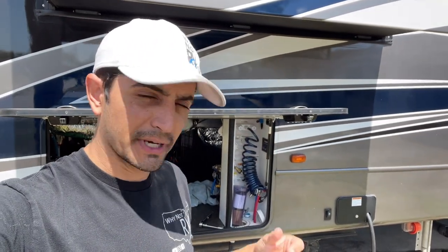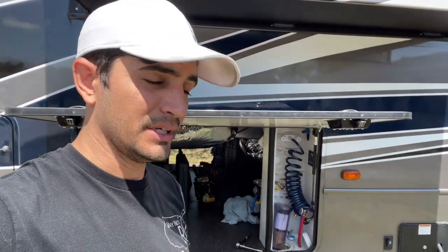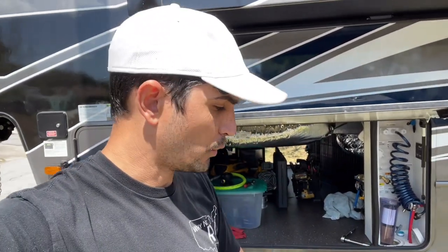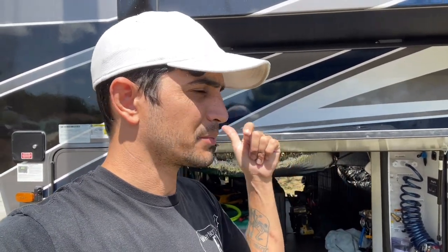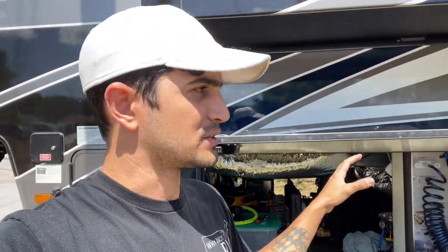I got the BMS all wired up with ring terminals on the end, so that's ready to go. Next I need to take out my old batteries and start putting in the new batteries. I've brought out one 48 volt set right here. I'm going to turn off my solar charge controllers, turn off my Quattros, and then disconnect the batteries and start to pull them out. It's going to be really difficult to record because it's dark in there and there's a lot of stuff in the way, but that's all I'm doing — taking out the old batteries and putting in the new ones.